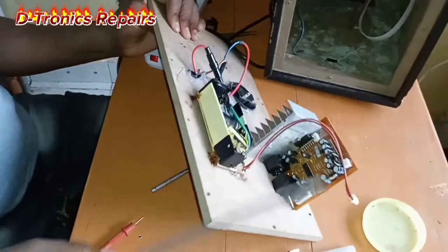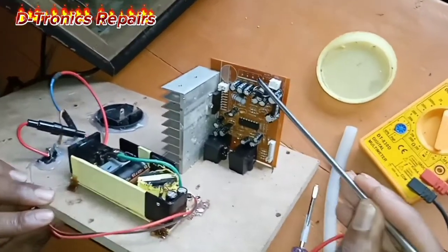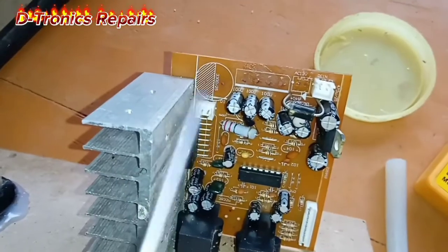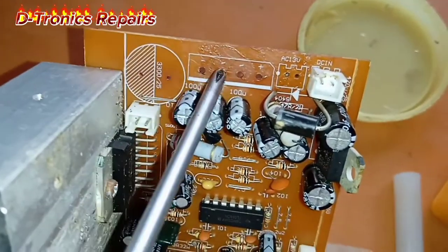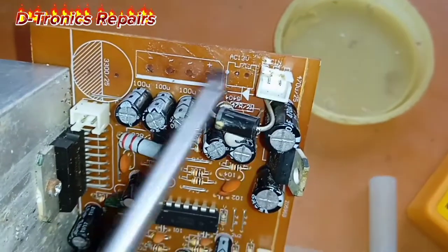The good thing about our motherboard is that the manufacturer has already given us the circuit for rectifying the AC current. So we just need to add a capacitor — 3300 microfarads at 25 volts maximum — along with our rectifier and connector, just like the one for the DC power supply.